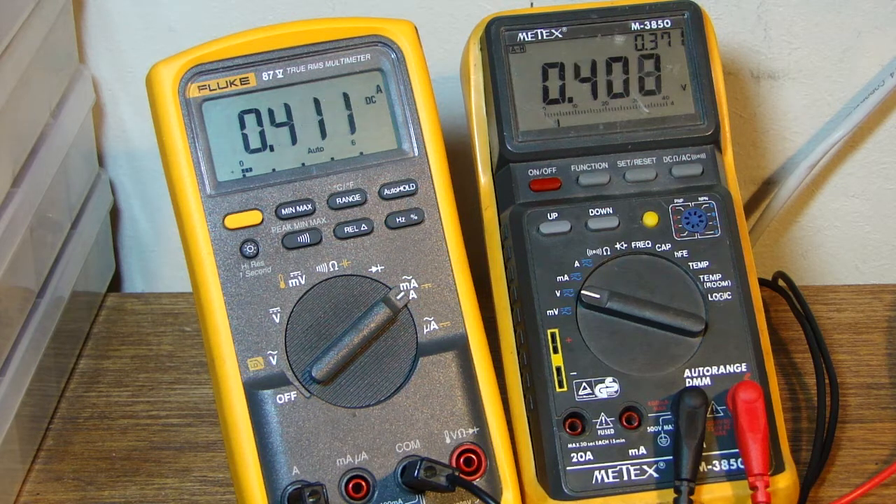Let's go to 500. As I said, at 5 volts drawing an amp — there we go, 500, or as good as can get to 500. Drawing about an amp, the 10x0.6 watt resistors start getting a little bit toasty. The power Darlington doesn't care — it's a 20 amp big bugger, so it could go a lot higher.